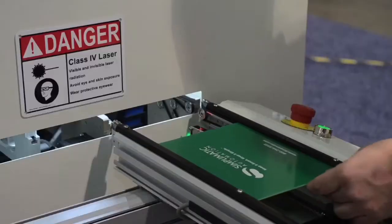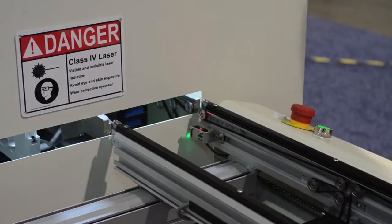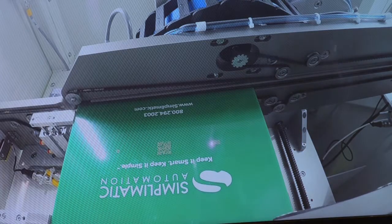So, you have a board in your hand. Do you want to put it in and demonstrate how it works? Absolutely. We're going to bring the board into position, move the laser into position. For the sample here at the show, we're putting down a QR code, a 2D data matrix mark that is 14 by 14 cells with a 0.25 cell pitch, and we're putting down a Code 128 mark as well for 1D. We're also putting a little bit of human readable on there. The machine is capable of graphics and images as well, so you can virtually print anything you need on the board, in any orientation, at any angle.